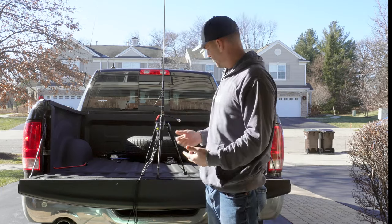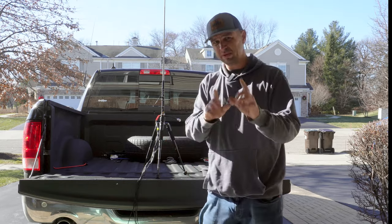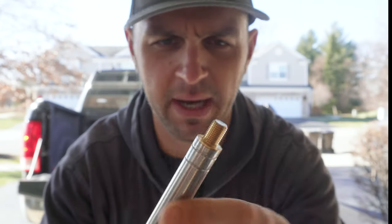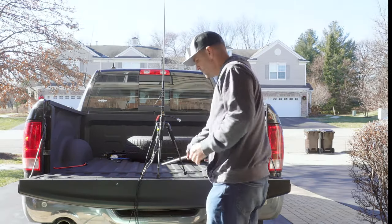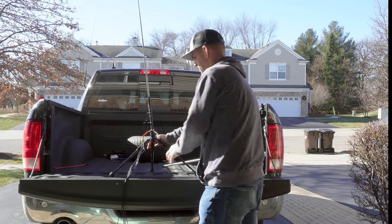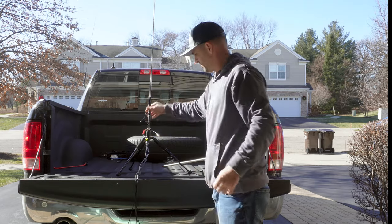At this point all I have to do is plug in the PL259 and check for SWR and start making contacts — really simple. But here is one problem: I think it would have been wiser for them to use a 3/8-inch female threaded hole in that tripod as opposed to using an SO239. That would let me use something like an MFJ pole, but that should be an easy fix — I should be able to find an adapter online. You could also set the leg width to your liking, depending on how much stability you need.